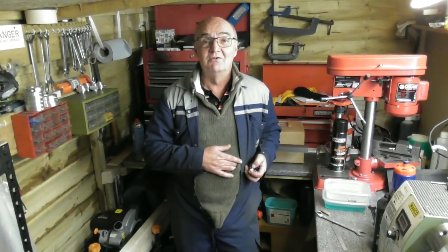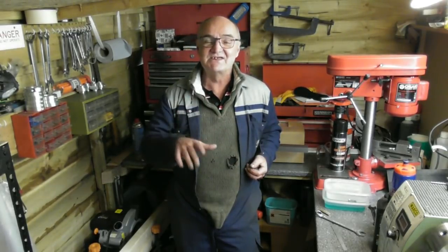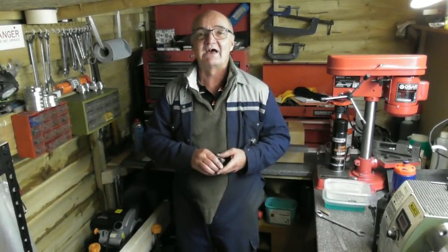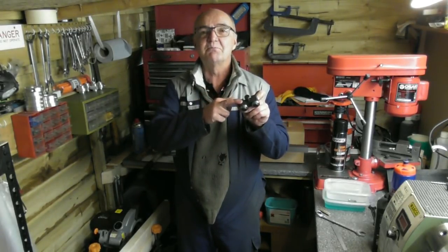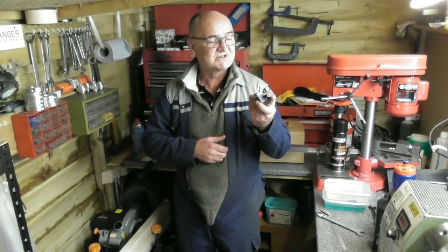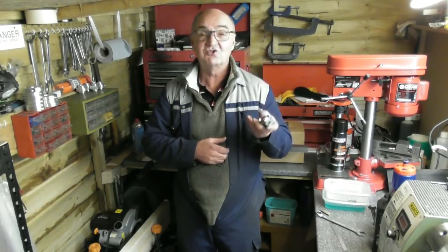Hi there and welcome to Wade's Workshop. This is episode 15 of the Quick Change Toolpost. The final episode will be episode 16 where I show another tool holder being made, going fast forward through all of that. This episode is going to be all about the surface treatments I've done on the pusher tool to prevent rust. I've done parkerizing on the block itself and heat bluing on the three pins. We'll see how it goes for rust prevention as time goes on, but it looks rather nice for now.